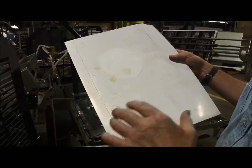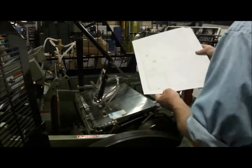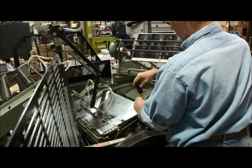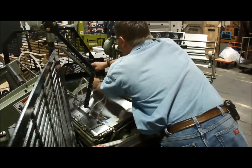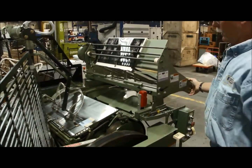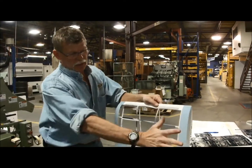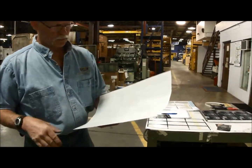So that's just carbon paper — rolled it closed by hand, let the sheet of paper on top of the carbon paper trace out where my cut rule is. Then put your spot sheet back underneath your die cut plate with your piece of tape on the edge. That's where I took the same stock and just folded it in half, taped it on top of the platen to get a fold image, and then I could see where I needed more pressure. Once I've got the die level to the platen, that's what I went through and hit the real sheet with zero cutting.